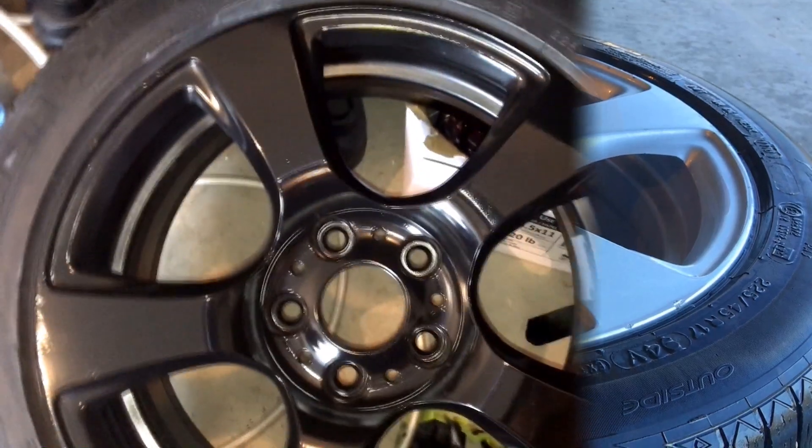While you let it dry for about an hour, close your garage door if you're working in a garage — you don't want debris flying in and landing on top of the wet paint. You can also put a cover over it. Don't sand the paint — that's a bad idea. Normally you can leave it as-is, but I'm going to apply a layer of clear coat because I want this to last more than a month, especially through winters.